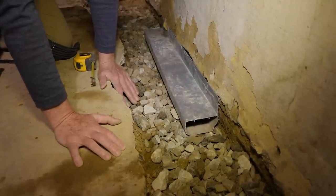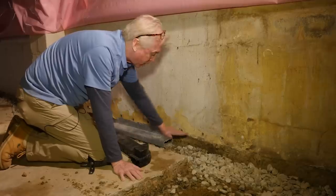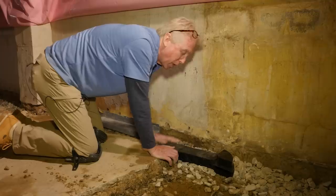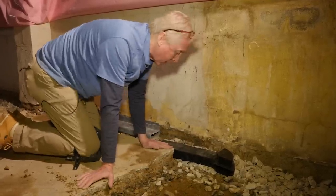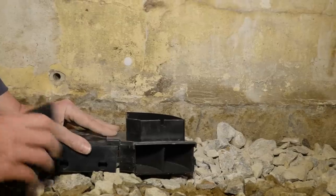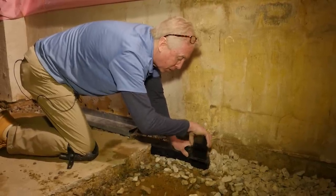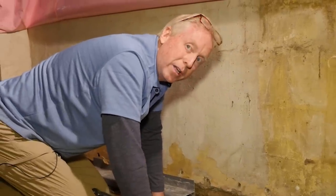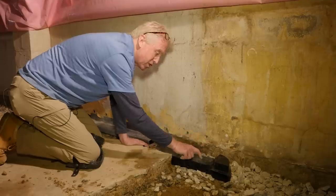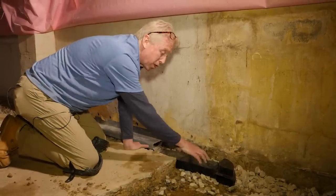The thing is, they're both about the same price. We've talked about how this system manages water within the depth of the floor. There's another type of system out there that doesn't sit right on top of the footing but sits at the exact same level, just out from the footing a little bit. This here is a clean-out — one of several installed with the drainage. It's basically a cap that allows you to flush the system out for annual or twice-yearly maintenance. The key thing is you can see where this system manages water: it has to fill up this high before any water flows through it.